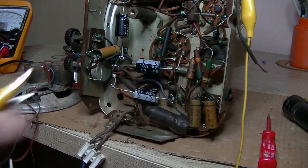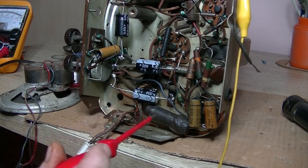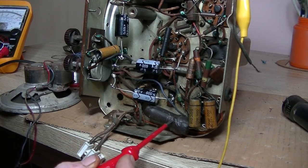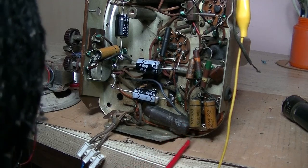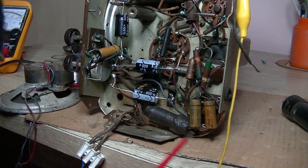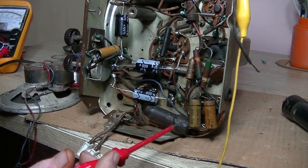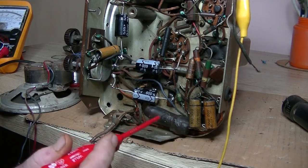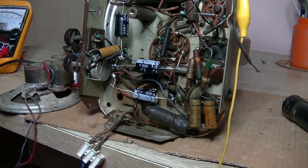And now I'm thinking, going back to when I was not getting proper plate voltage, I'm going to focus on that. What I'll do is test the valves, make sure they're okay, but I'm going to change this, because it looks absolutely stuffed to me. The bulge on the end of it is horrific, and it's connected directly, I think, to the plate. No, it's not connected to the plate, but it is connected to the valve, the 6v6. It could also be these two little caps here causing problems. One of them, that one, is connected to the plate. What is that, 0.005? But I'll test the valves first, and if they're okay, then I'm going to swap these things out. I'll find out what that is exactly. Like I said, I thought it was a 0.1, but it could be a 0.01. If it's rated at 600 volts, it would definitely be that big.